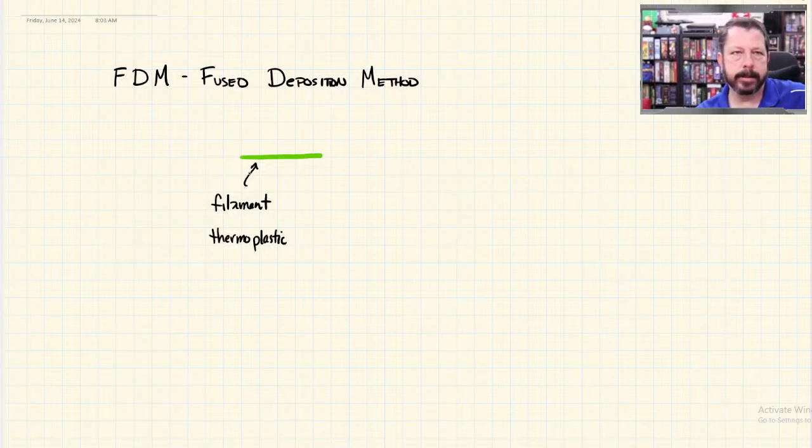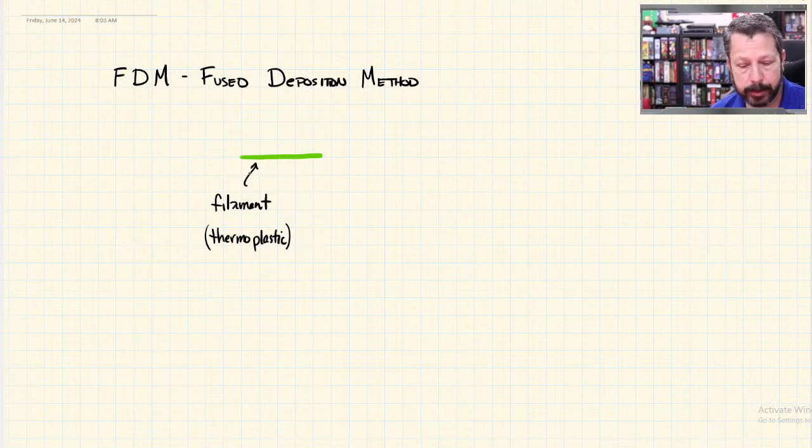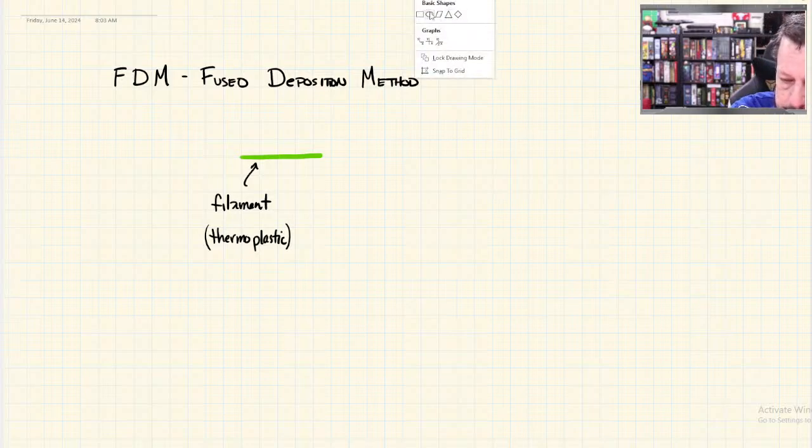That basically means that it's a polymer that doesn't melt, melt meaning turn into liquid. It does soften though, and when it cools, it holds its shape. So thermoplastic. There are a few people trying to get thermosets to print. They're a different beast altogether, but they do have some nice properties. But pretty much everything that you're going to print with in the next year is a thermoplastic, assuming you're doing FDM printing. All right, so this filament gets fed into a pinch roller usually.